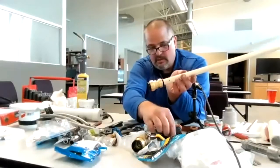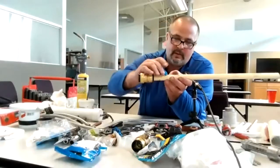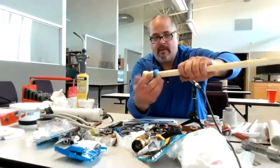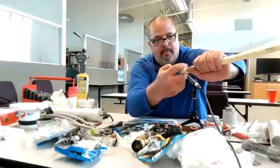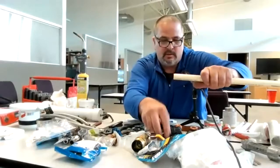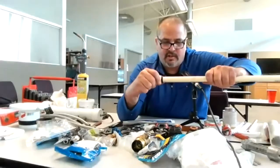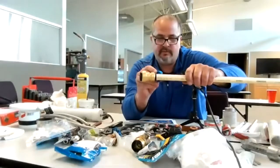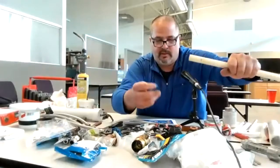What if you made a mistake? Well, they make these little tools. You snap it on, push it up against the pipe, push against that black ring, and pull on the pipe and it comes right off. Two steps: get it in there first and push hard — you'll hear it go in. If you want to take it off, push it up against the black ring and it comes right off.